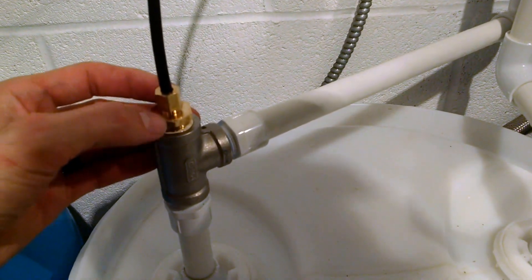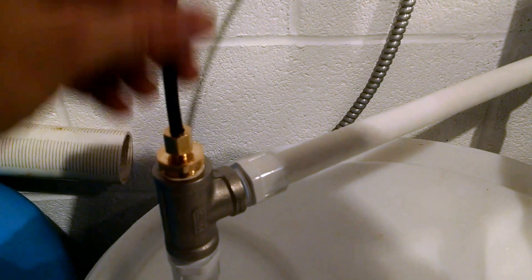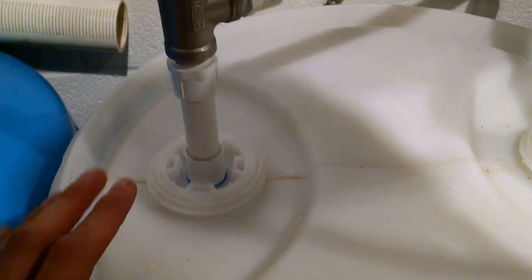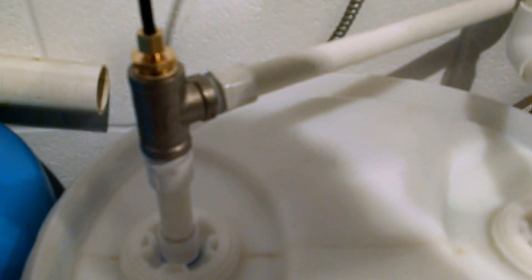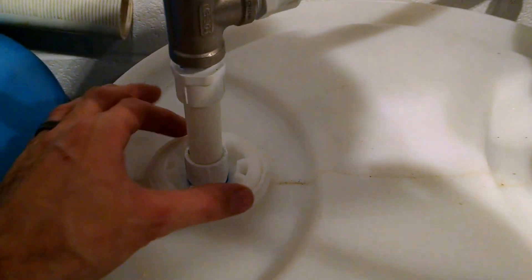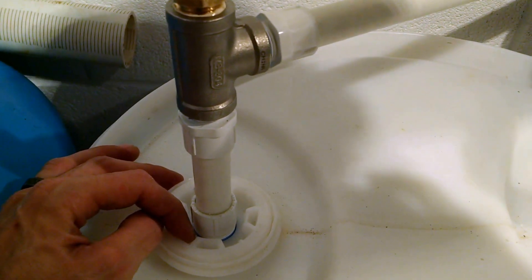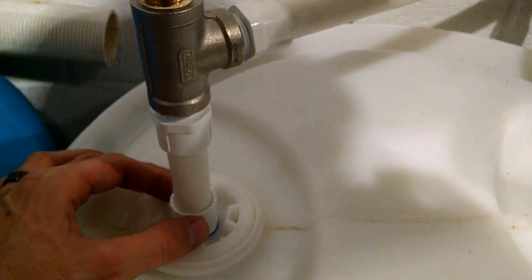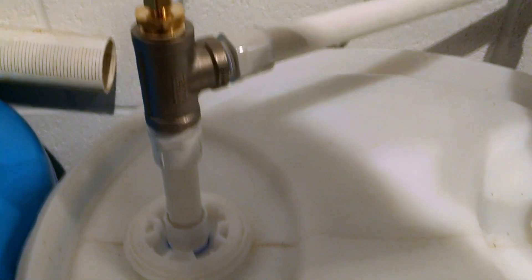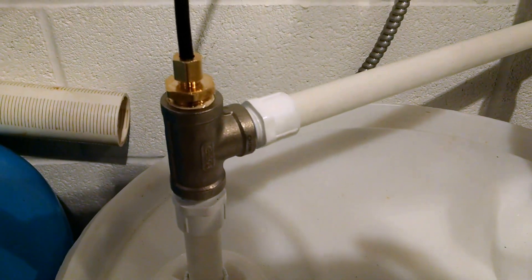I used a ½-inch male threaded adapter to a ¼-inch OD compression so I can get a nice seal. The goal here is that when this barrel fills up, it'll rise up through this tube and then go into an overflow tube. So all this has to be liquid tight — just enough so it's not going to drip around everywhere. This is a 2-inch bung that had a ¾-inch threaded female, so I went in the underside and cut that out so I could screw in an adapter — a ¾-inch to a ½-inch adapter — and I used ½-inch PVC. This is a stainless steel tee I got from SupplyHouse.com, threaded on all sides.